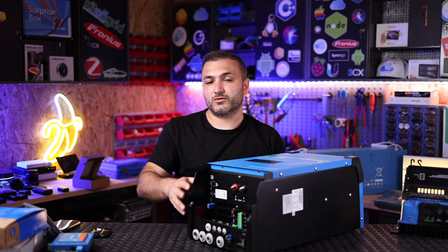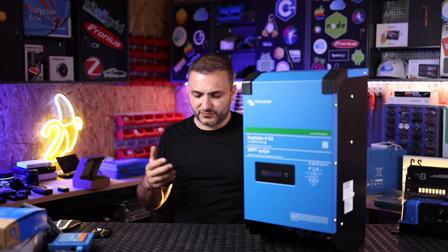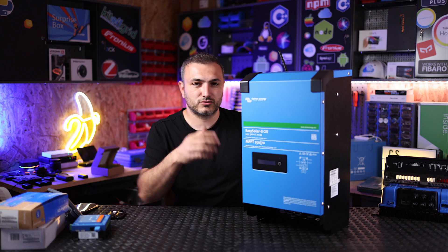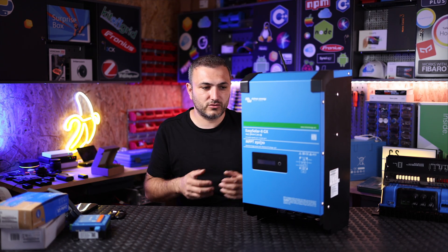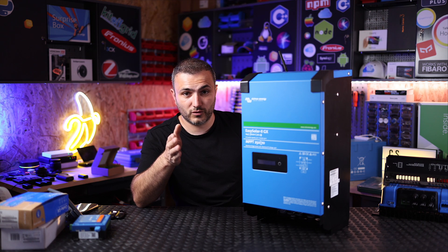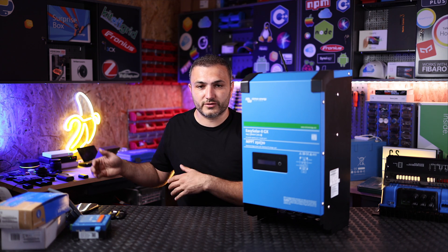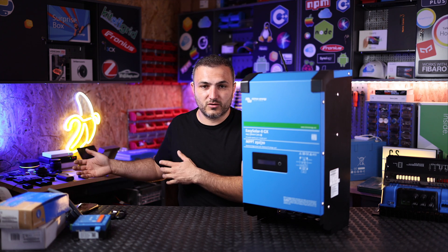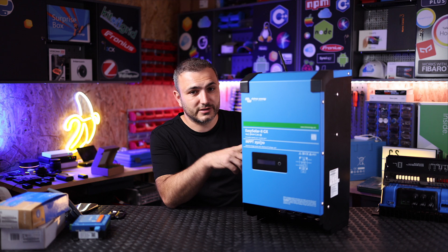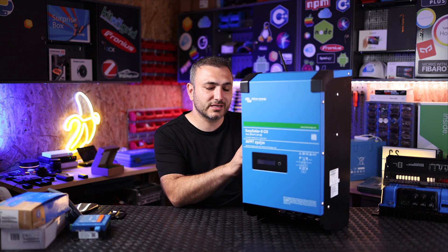So this is Easy Solar Generation 2 — these are the ports and what you can find inside. Now let's talk about power. As I told you at the beginning of this video, Victron has three units in this Easy Solar family. This is the smallest one, it's 24 volts, can deliver up to 2,400 VA, and it has a transfer switch so it can let you draw from the grid through Victron around 8 kilowatts. The next one is the same power but connected to 48 volts. It's more efficient if you decide to add bigger storage, because it's easier to put storage in 48 volts than 24 volts. Imagine you want to put 30 kilowatt-hours of storage in 24 volts — you need to put all the cables in parallel and you need very thick cables to connect to the battery. In 48 volts, the cable diameter will be half.